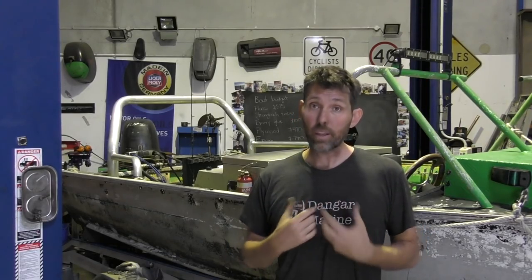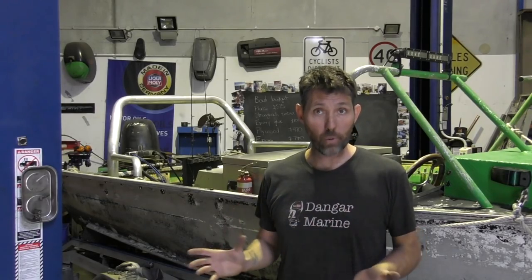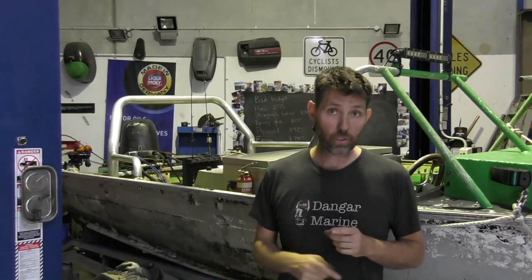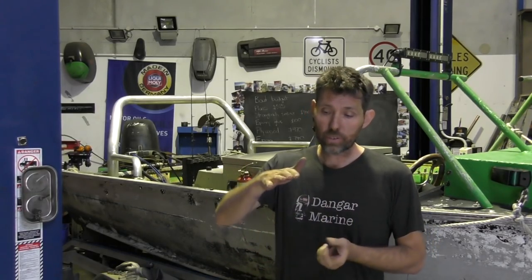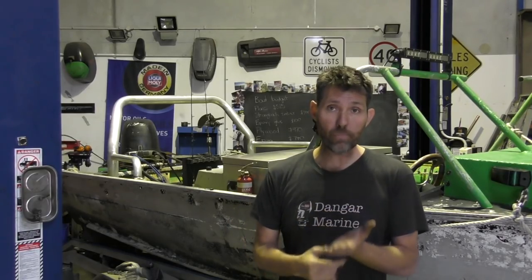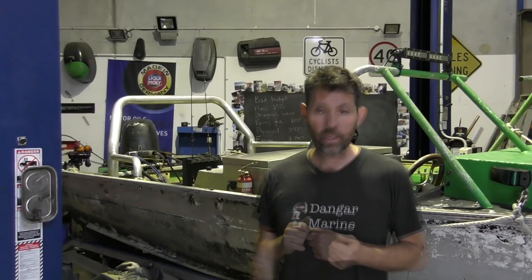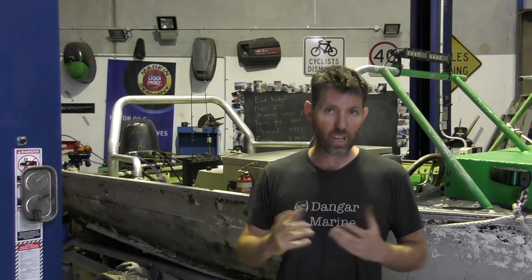It kind of brings me back to that video I never filmed about requirements. The way I use my boat is very different to the way other people use their boats — this may be totally inappropriate for some people, but I think it'll work for me. The main reason I wanted to do this bar is because I want to do a video on towing a boat. I did think about running some wires through the bar before I put it on — the flanges on the bottom are solid, so I don't think it'll be any easier to put the wires in later. It's really good to do all your welding first, because otherwise you run the risk of melting the wire insulation and having them short.